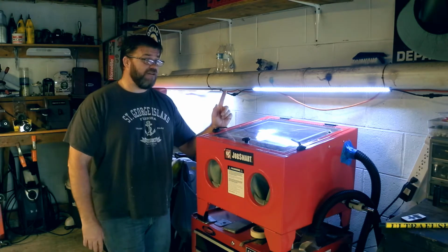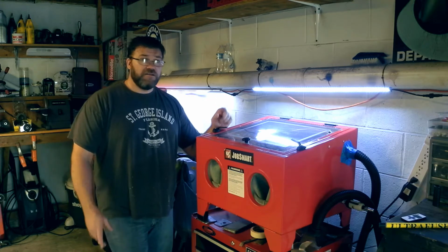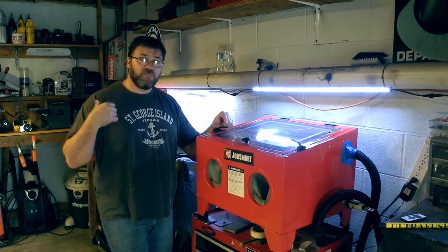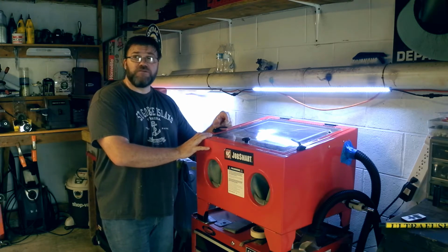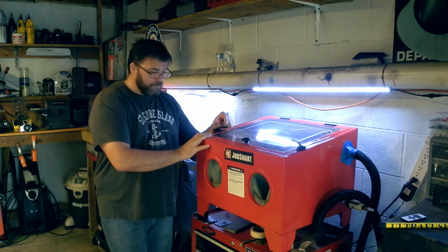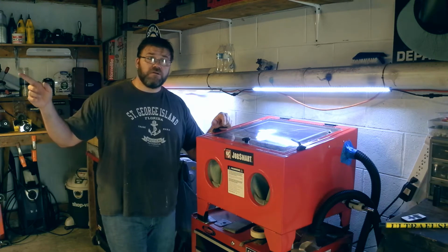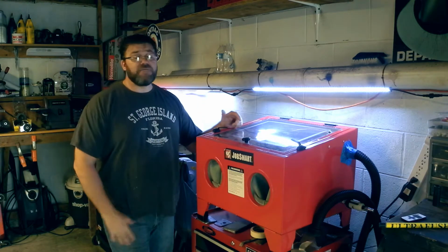And the funny thing is, I found out that this garage, the way it's wired, does not like to run my compressor and the shop vac with the lighting when I'm doing this. I popped the fuses yesterday about 6 times. So I moved the shop vac to a different connection run to a different circuit breaker, and I didn't have any more problems.